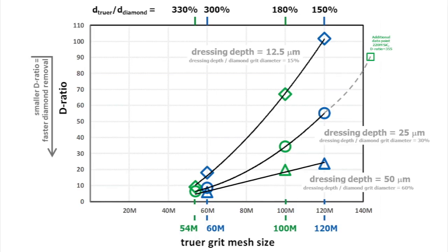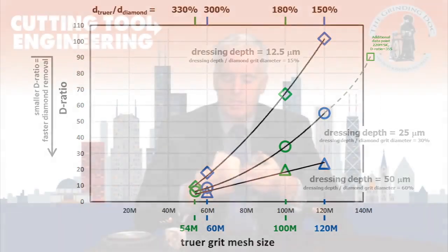Using smaller grits for a sharp corner may take a little longer, and you'll just have to live with that. If it's taking longer than you like, you can be a little more aggressive by getting a speed ratio closer to one, or go unidirectionally with the finer grit. You may also want to use a smaller dressing depth and a slower traverse speed when you have a sharp corner to hold.